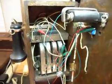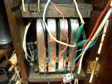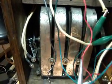So you have to install a switch on these, and some of them can be different because not all these cranks are created equal. If you look back in this area of the crank, I had to remove the crank and everything and mount a switch. You have to mount it on the crank, because if you mount the switch on the wood and the crank moves any, then the switch is so precise, it'll get out of whack. It has to be mounted to the crank itself, so it stays stationary with the crank. If you can see here, with one hand I'm going to turn the crank a little bit, and you're going to see that movement, that engagement. That's engaging on a switch that we installed.